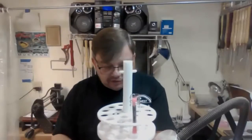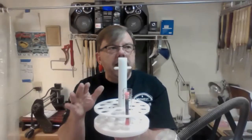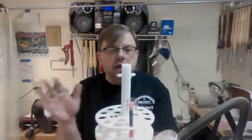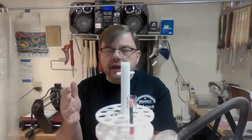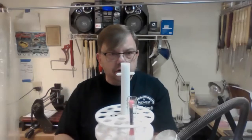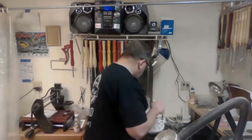If I'm doing Silmar 41, which is what I'm doing, I'm going to let it sit in the pressure pot at least a day, 24 hours. That's just me. If you're doing Alumilite, you can pull it out probably in 90 minutes, as Eugene said, 90 minutes, maybe 2 hours, and I'm able to pull these things out. So any questions on the setup?